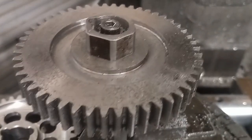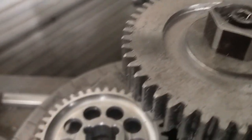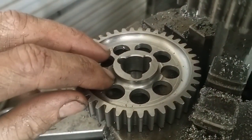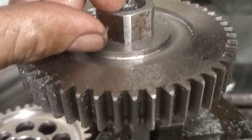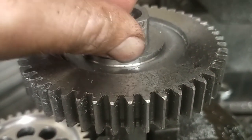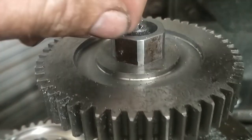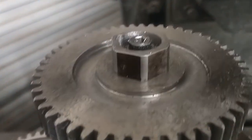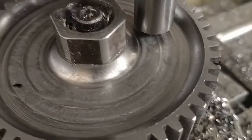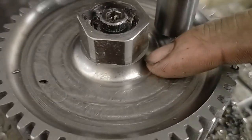So we've got all 50 teeth fully cut to full depth without any hiccups. The next step is to put a radius in there and there, flip it over, do the same thing, then put some holes in it. Because we dialled this to 0.01 runout and that was machined in the same setup as the bore, we can just cut this without worrying about the dialling surface. We have machined a nice radius in the fillet there and in the fillet there.